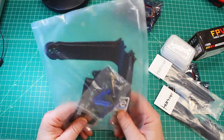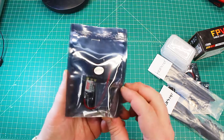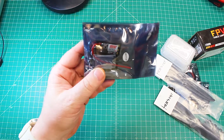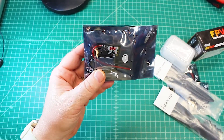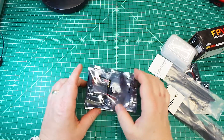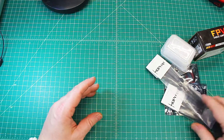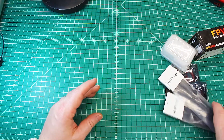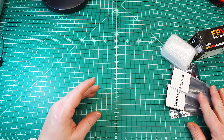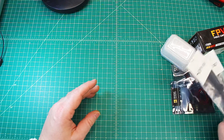That's what a lot of these parts in this box are for, so stay tuned for that build-out video. For ESCs, we're running the DYS XSD 30 amp — these are D-shot capable ESCs. 30 amp is plenty because we'll be running a 1900kV motor which will pull less amperage. We'll be running between 4S in parallel sometimes, then 5S, and probably even 6S.